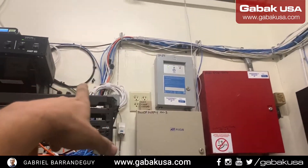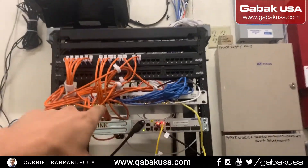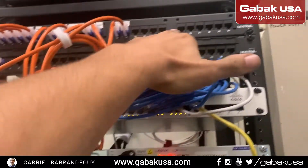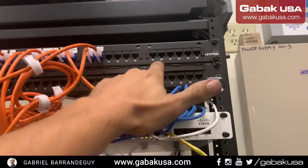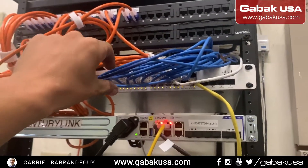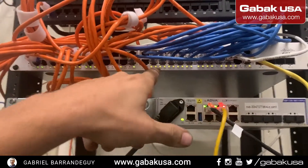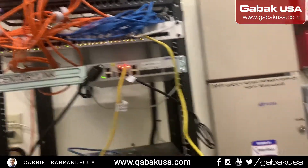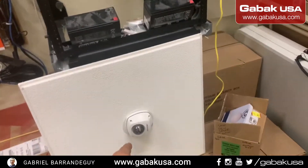Make sure the cables are 100% copper. Instead of having all the cables spliced with couplers, I would recommend using a patch panel — that's what it's there for. Some people want to do a quick job and end up doing things this way, but a patch panel is the right approach.